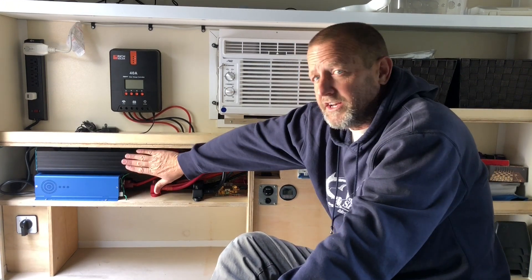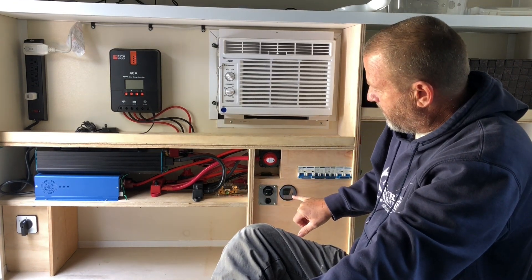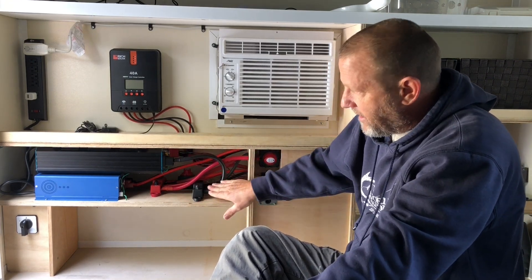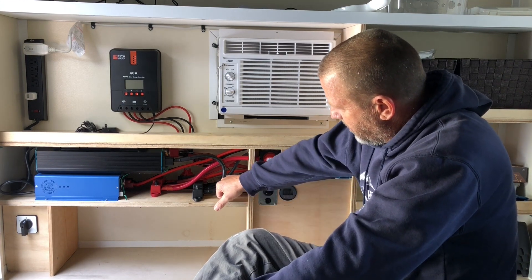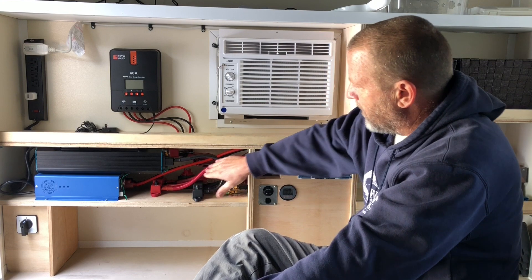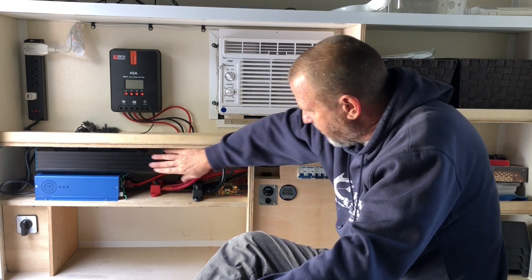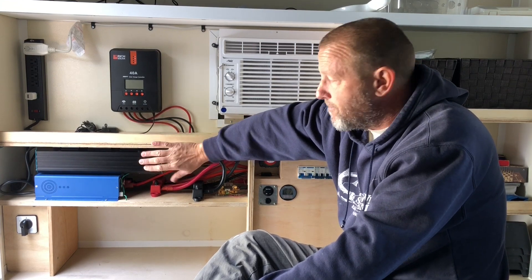What I have here is a Renogy 2000 watt inverter. On the negative side, I have an AILI battery monitor connected directly out of the battery. Out of the battery goes to the bus bar, and the inverter is connected to that bus bar feeding the hot side. I have a 200 amp fuse and a main disconnect for the battery, then the hot side feeds to the positive bus bar. Out of the positive bus bar, I have 1-aught cable coming through an isolator switch and back into the inverter, so I can isolate the inverter at any point since it can still draw a little power even when turned off.